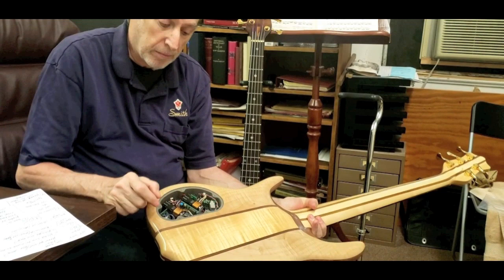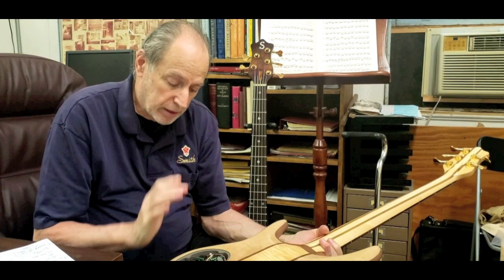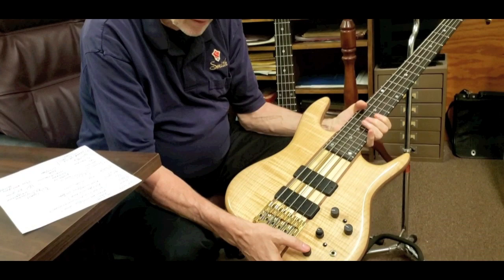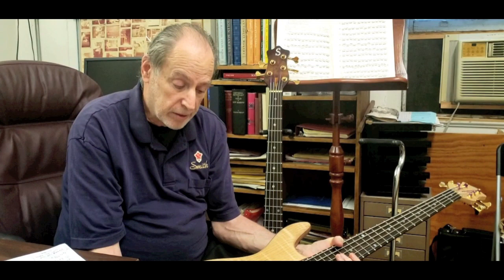Now I can make this 9 volts by only putting one battery in and shunting, putting a covering in the base to only work with one battery if you just wanted that, which is a slightly different sound, a little less power on the output, but within 95%. Also, there's an added mid-range board, which is here. This is mid-range. Of course, this is the five-knob layout, not the three-knob layout. But this exact circuit can be used as a three-knob, which we're working on right now as we speak. We're making six strings, three-knob. Some will have the added mid-range. And that'll be concentric bass and treble, the volume and the balance, which is the original BT three-knob.